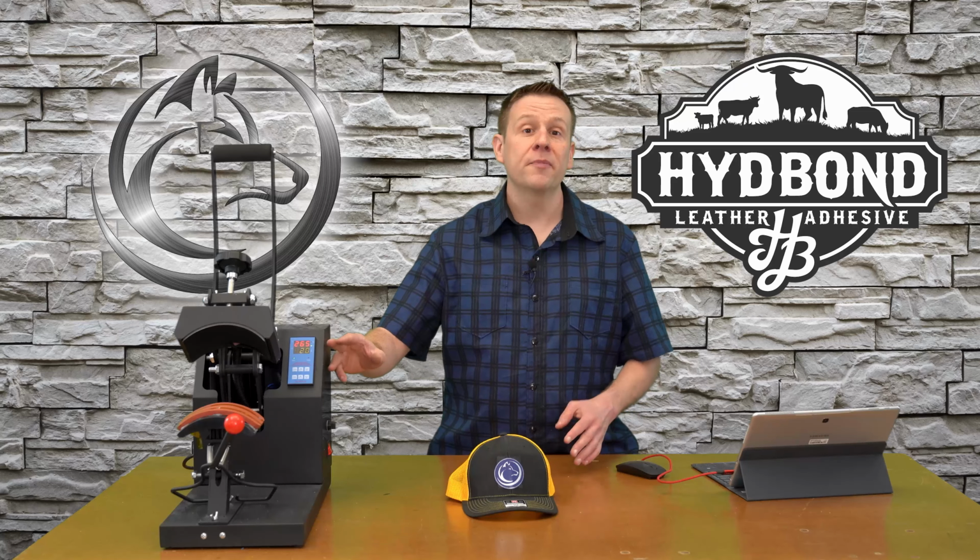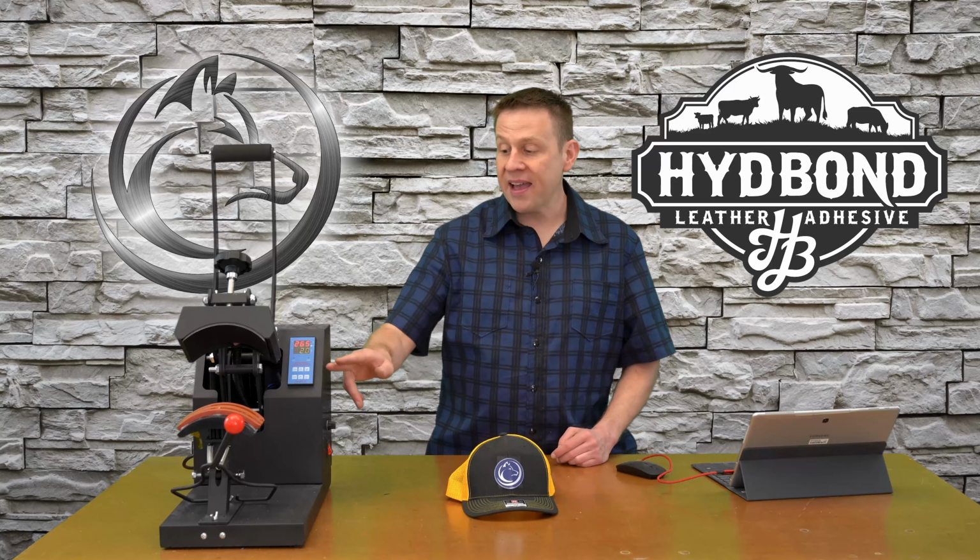In this second video of the series, it was really nice to be able to use a CO2 laser machine to engrave and cut out the patch, along with using a proper heat press where I can set the temperature to an exact amount, and I have a timer to know exactly how long I've been heat pressing the patch. If you've watched the first video in this series, you'll know that I used an xTool laser diode machine to make that patch, where I then heat pressed it onto a piece of sample denim cloth.